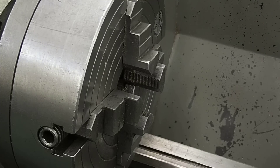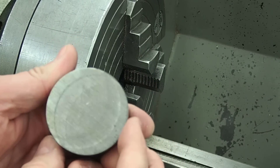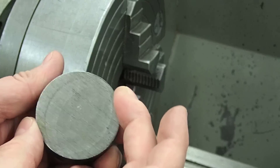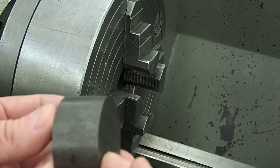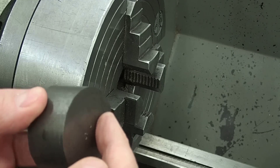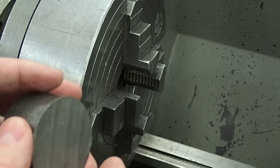Today I'd like to show you how to turn a square on a lathe. What I have is a piece of material - in this case it's two inch diameter and it's about an inch wide. I'm going to put it in a four-jaw and I'm going to face one side, flip it around, face the other side, then we're going to make a square out of it.